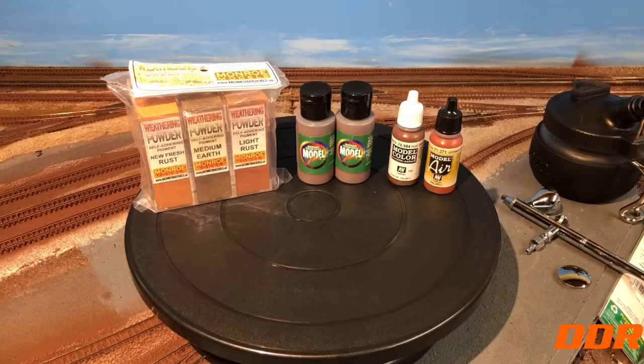Turned out it was on the outside of the house — the caulking around the air conditioning lines coming in. The foam insulation covering the lines was totally deteriorated and would fall off as you touched it, dry rotted. So I had all-new insulation put on, had the guy strip all the caulk and put all new caulk on. That stopped it. There was a pretty good gap, about 3/8 inch — they were following those lines in. That's also why I got earwigs, because they like moisture, and then the ants started following them.